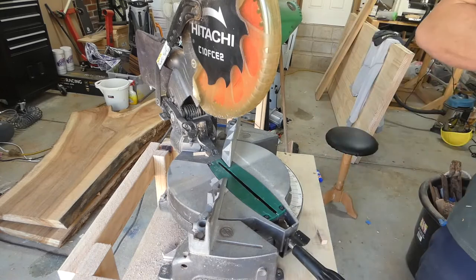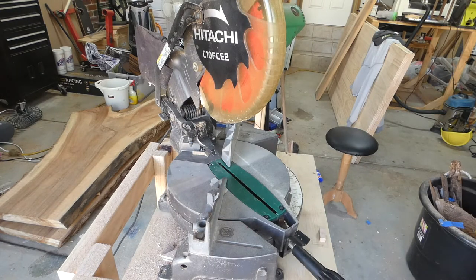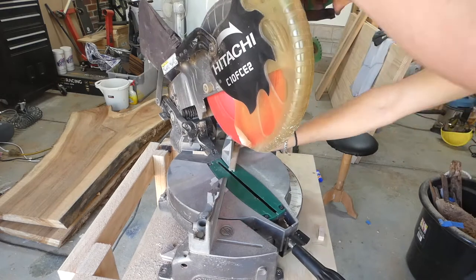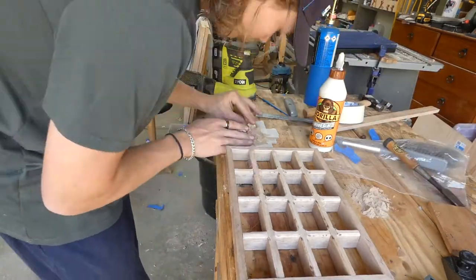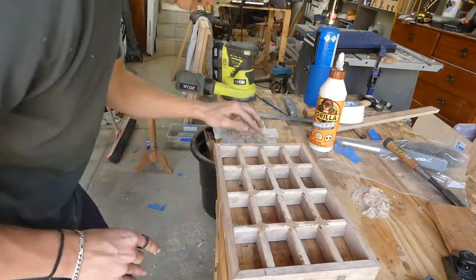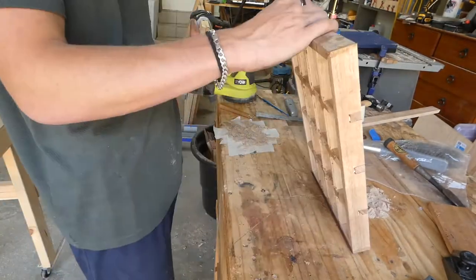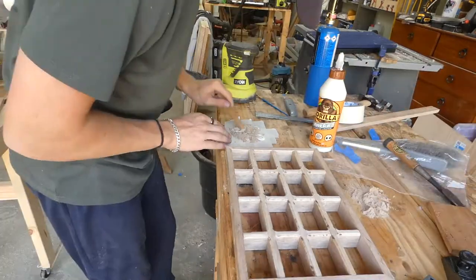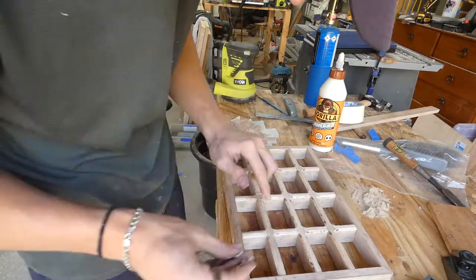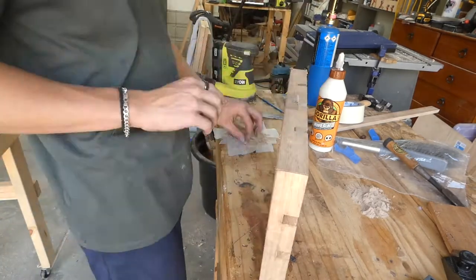After the miters fit together — you can see me doing the top of the miters — I did them together so they'd be even. I made sure everything fit together nicely and was framed correctly, then started the final touch-up process: mixing timber shavings and sawdust with glue and filling in all the spots that needed it.